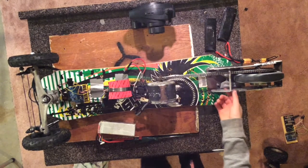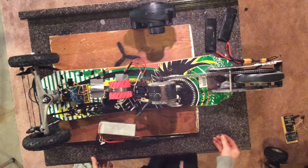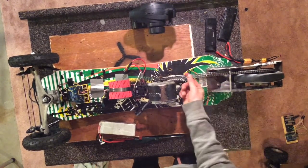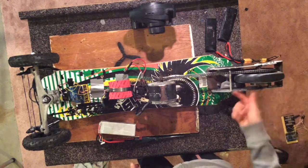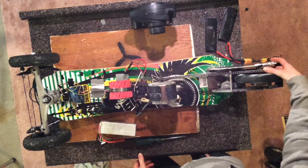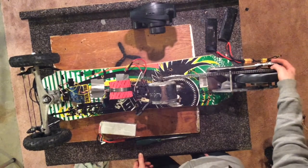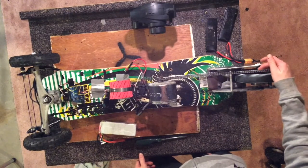And a kick scooter, you just basically kick a back peg and it converts that linear motion into rotational motion, which moves a chain and spins a sprocket, which spins the wheel. For this piece, I ended up changing out the sprocket with a larger diameter sprocket so the gear ratio would be right, because if I used a smaller sprocket, I wouldn't have nearly as much torque as I do with a bigger sprocket like this.